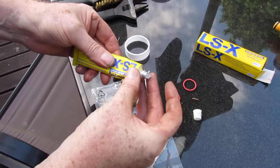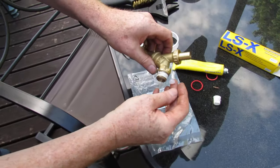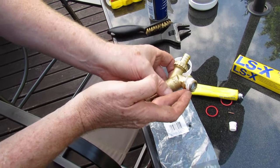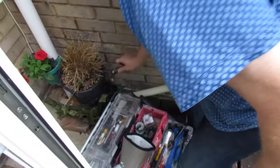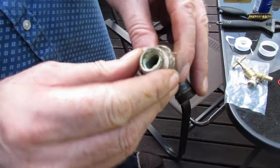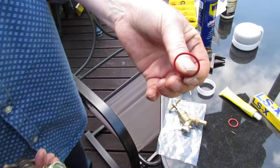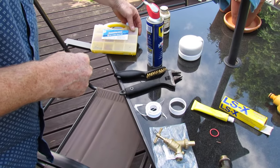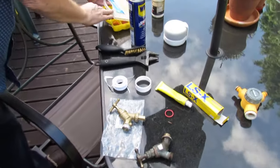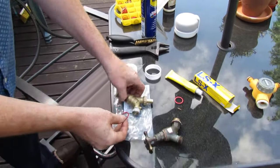This other stuff is about five pounds - it's LSX - and it looks a bit like silicone. This stuff will dry in water as well, which is handy. Take it from me, you won't have any leaks with this. We don't really need to put this on but we're just doing it for a belt-and-braces approach. On the old one - you can see what somebody's done - there is a washer, and this is important because if you don't put this on your tap won't seal and it won't sit straight. You'd need to tighten it up too much otherwise. We've got a Tool Station fibre and rubber washer pack, probably about ten pounds, and that lasts a lifetime - so that goes on there.